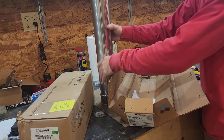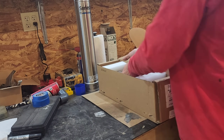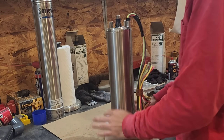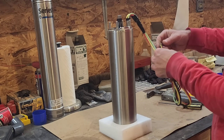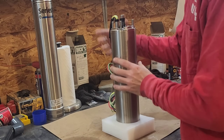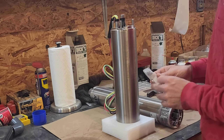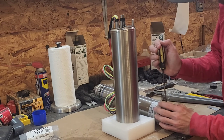There's the pump stack. Six-inch box for a four-inch motor. We're going to take the bottom styrofoam off. Might have to twist these — going to go ahead and hit these with a soldering gun and put the stacons on first. We're going to take the stack here. We've got our hardware inside, all stainless steel, so first things first is we have to take the screen off.